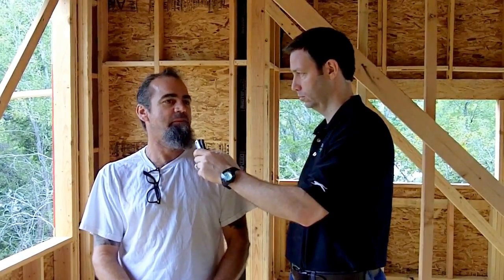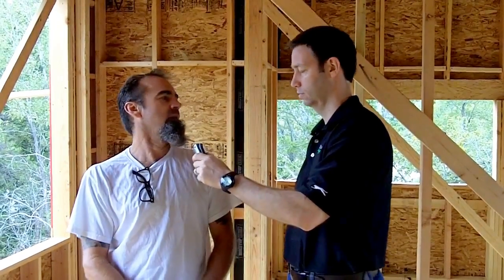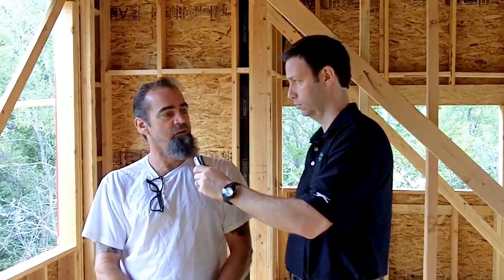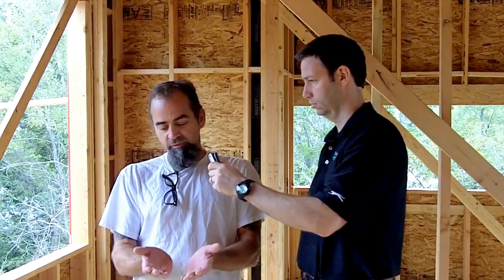And Matt, what typically happens on the job site, as we all know, is we have our lumber pile out there, and those 2x12s, or all the lumber, comes out fairly wet, especially here in Texas, where it's so humid and so hot, and the sun is just beating down. What happens is on the sun side of any piece of wood, it's going to start to curl up as it dries faster on the top than it does at the bottom.